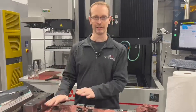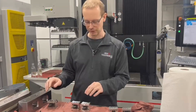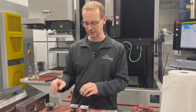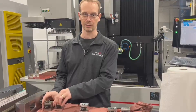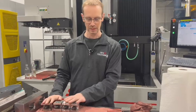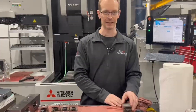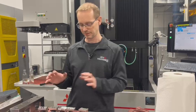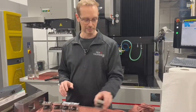One thing I wanted to talk about is when I learned how to do this over 25 years ago. I was running an old Accelo machine and I literally had to make four electrodes to do one location. For each additional cavity I had to add an electrode, so I would end up having a pile of electrodes to do a similar job — which now I can reduce a lot of that work.